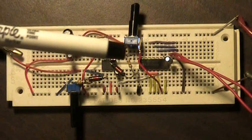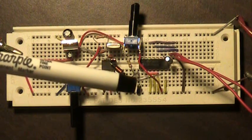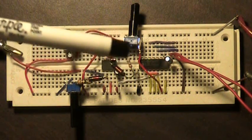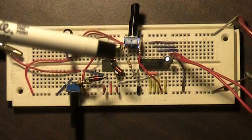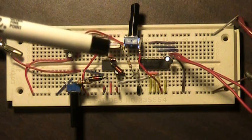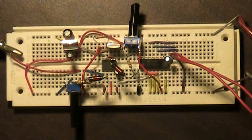Up on the top side here, this is actually your tuning. There's a diode at the very end of the pin — it's pulling this diode in a way that allows you to tune around slightly. So even though your crystal is operating at a set frequency, by varying this variable resistor you can actually tune around about one and a half kilohertz. From there you can control your tuning a bit — so if somebody is trying to talk to you and they're slightly off frequency, you can compensate a bit with that.